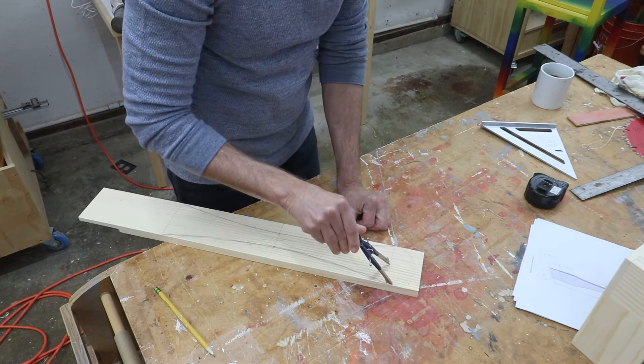I really like the look of the joinery on this version, so rather than paint it I'm going to apply two coats of tung oil finish. This will give it a nice earthy natural look and provide a little bit of protection too. Tung oil is really easy to apply — just flood the surface, wipe it on, wait 10 minutes, and then wipe off the excess. You can build it up by waiting 24 hours between coats and buffing each one down to a nice satin finish. The only downside to an oil finish like this is that it's a maintenance finish — you'll have to reapply it every year or so. But let's be honest, you're not gonna do that. I know I'm not.